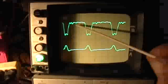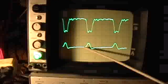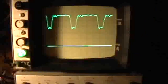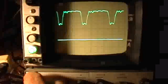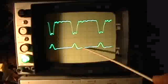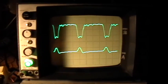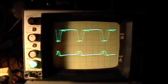And then the positive going portion of the current waveform gets multiplied by this portion here where the battery voltage is actually very low. Let me make sure that that's actually on its baseline. It's down a little bit, so it's not as low as it looked at first. Should be right there. Okay, that's still pretty low on the battery voltage, 7 volts or so. So this trace is going to be a strong negative. Let's make sure that one's in the right place too then. Sorry, we're triggering on that one. Yeah, that one has not moved.